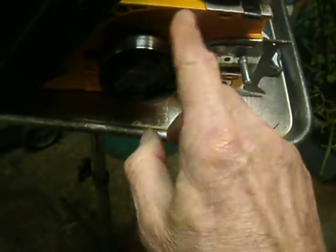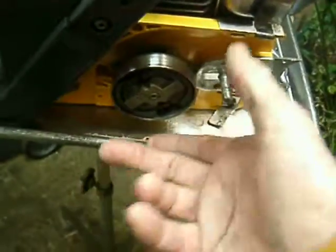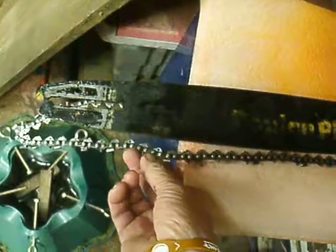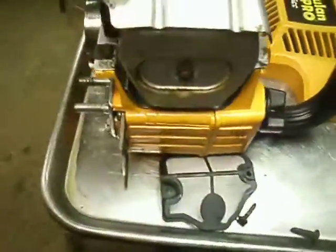The biggest question everybody's asking is what else am I going to do? I'm going to put a chain catcher on it because the chain catcher is crap. I'm obviously going to replace the clutch, sprocket, drum, and bearing, because there's no point in putting this saw back into service — that's dangerous, that's ready to hurt somebody's feelings. I'm going to put another bar and chain on it, because the original is the standard $12 black bar with the super low kickback, dulls in a heartbeat, and wouldn't cut a plastic straw. I've already had the saw running and cut with it, then finished up the cleaning.